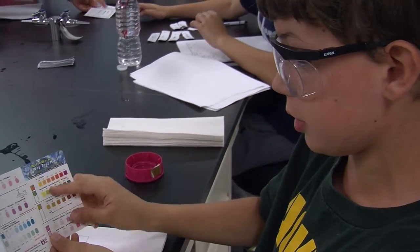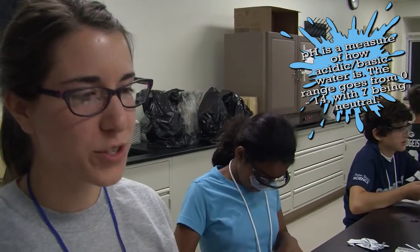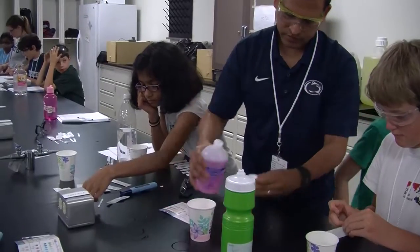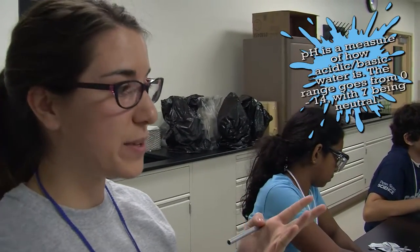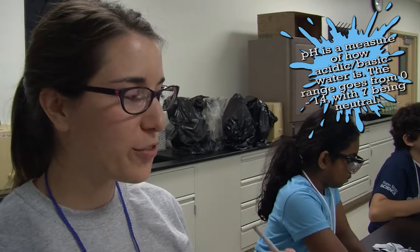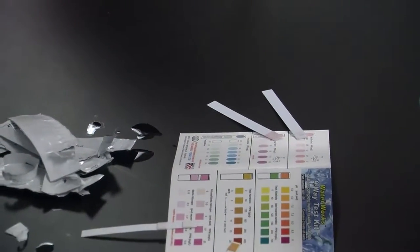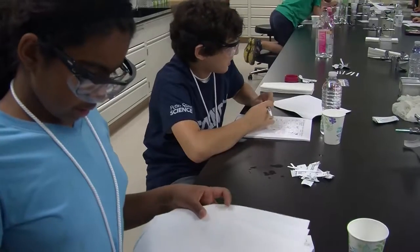Darker color seems to be more basic. In testing this water for pH, if the water is too basic or the pH is too high, that could be bad for the piping and also make you kind of sick. Something that's basic that you probably know about are soaps and detergents. At the opposite end of the scale would be something with a low pH or acidic, like lemon juice. This pH reads 11 — water is supposed to be like 6.5.